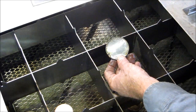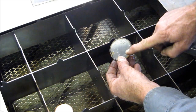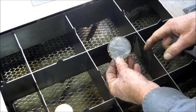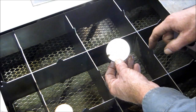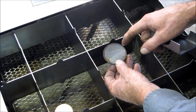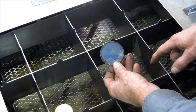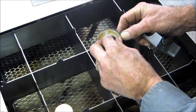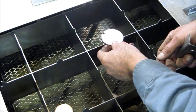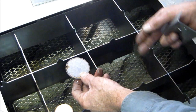These are the stainless steel rings that we've been cutting out — there were quite a few of them in that one area. This is an advantage of having a water table: the parts drop down in there, and even though you continually plasma cut over the top, the hot dross and material flying down into the hole is not sticking to the stainless at all. Note: if you've got plastic between your part and the table, you're not going to have continuity to ground.